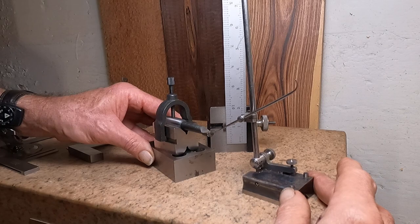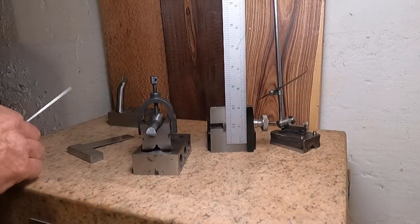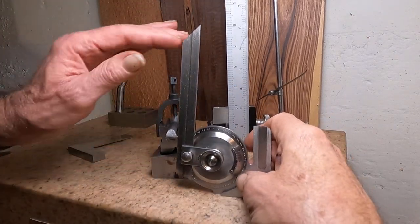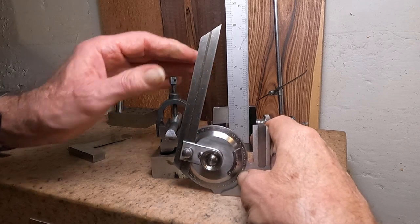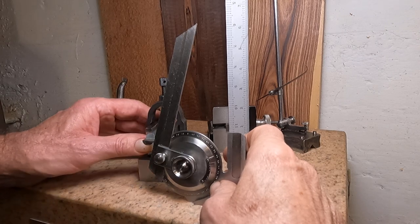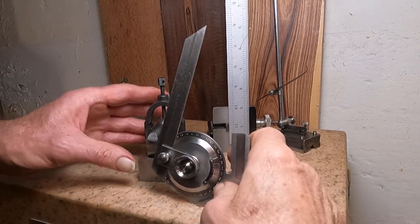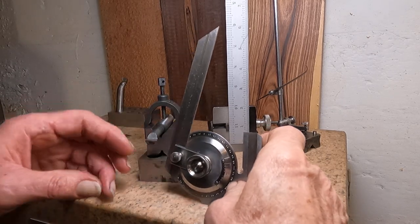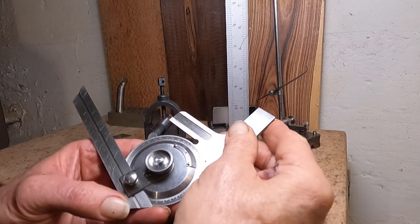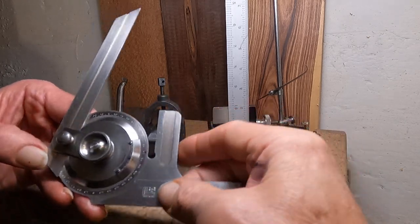Ideally that's how it is in your boring head — tip centered. Now I'll bring the bevel protractor up here and see if we can check the relief angles. I'm going to have to get my head down. There's quite a bit on this one — I don't think this has been reground, but it needs to be ground anyway.